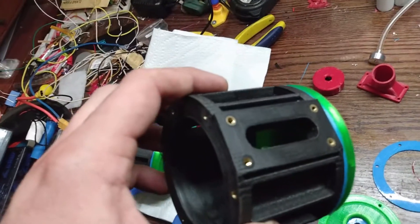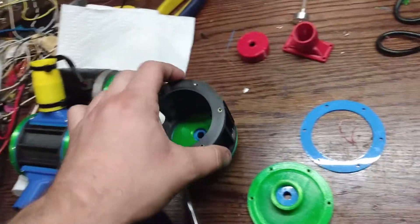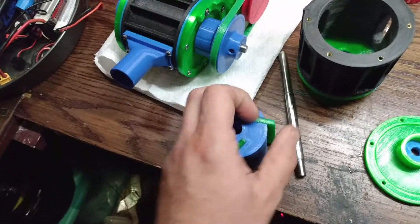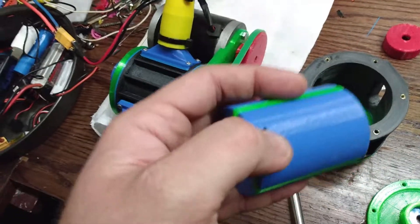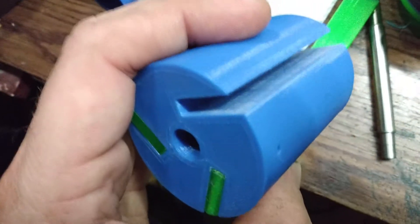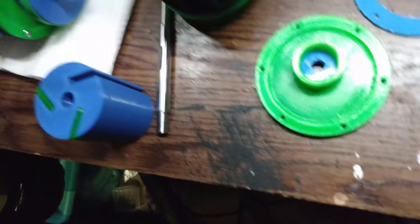This one here has larger ports, better smoothing on the ports in an attempt to make it a little bit quieter. On the rotor, I've changed the apex of the seal so it's off center, which should cause less friction and increase the pressure holding. I put a little hole here that leads inside to push the blades up against the outside of the housing.